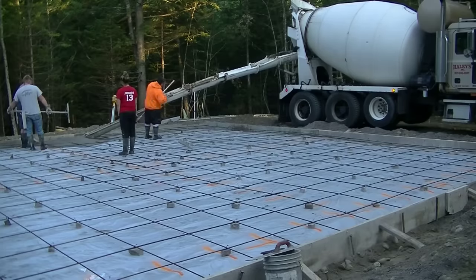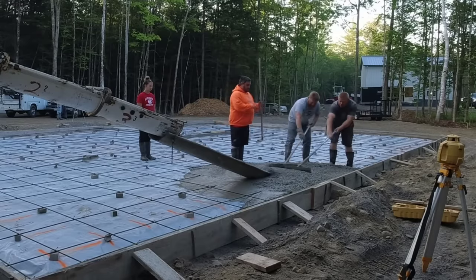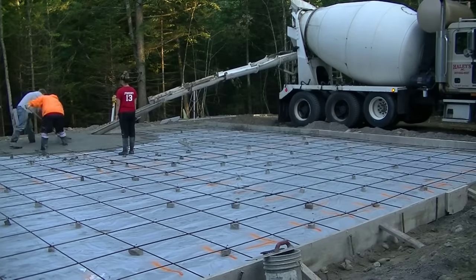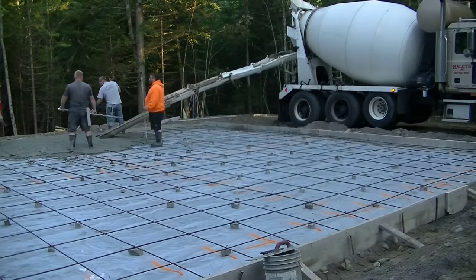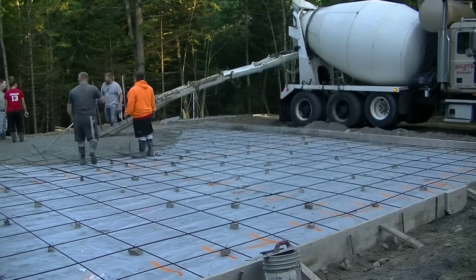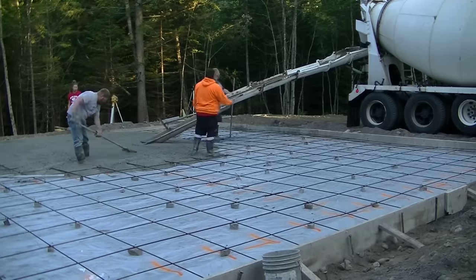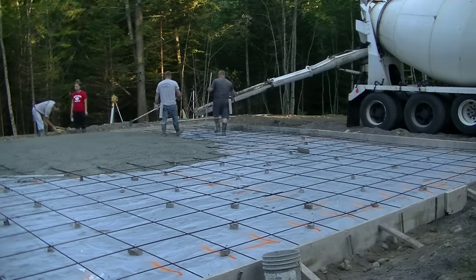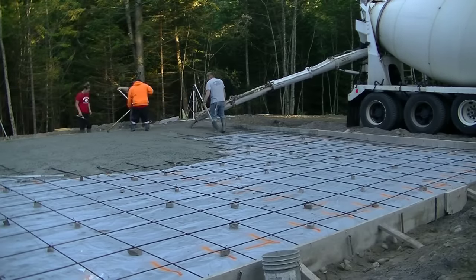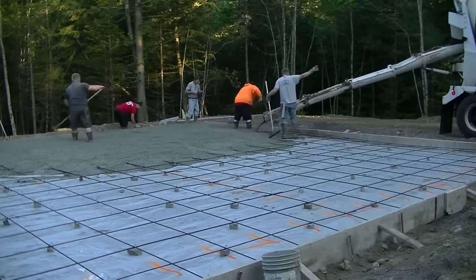You can see we put a ton of bricks under that to make sure it stays up into the slab. So now it's pour day. We're going to get the concrete poured out. We got 42 yards coming — it figured right around 42. The level of the gravel was pretty good, it was within an inch. And the thickness of the haunch on the outside edges was all pretty consistent. Let's see later in the video if 42 yards did it or not.